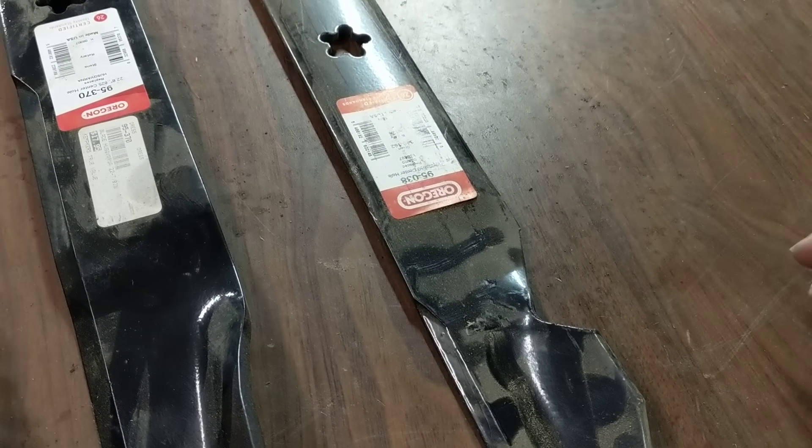Back here is what is called a sand blade. In our area we have some sand. These are not made in every size or to fit everything, but what this does is it still gives you a lot of lift. Sand is generally hitting on the outside, and when you look at a blade ran in a sandy area, those back flags or lifts start wearing really thin and breaking apart. This allows the sand to channel out without degrading the blade as fast. Our city parks department runs it on some parks that are in a sandy, next-to-the-river area. You get a lot better life out of the blade and they still have decent lift.